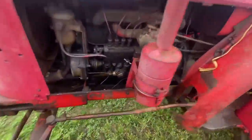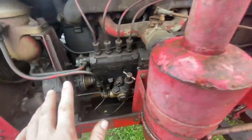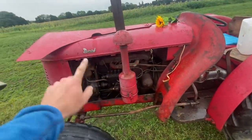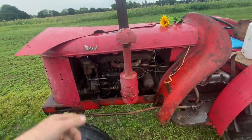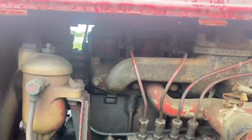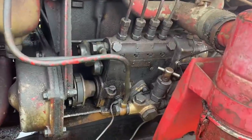If there's anyone older watching — is that a lift pump? Does that need to twist and pump up and down? Because we think it's just got air in it and that's why it won't start. It drove from up there and then conked out, so we think maybe the fuel siphoned back or whatever — it's got air in it and that's why it's not going. It's turning over now but just not firing properly, just the odd splutter. We found the decompression lever up there so we're going to wind it over and pull the fuel through.